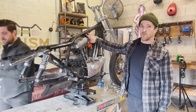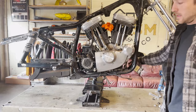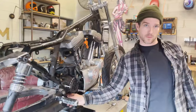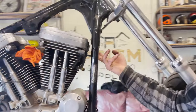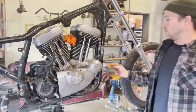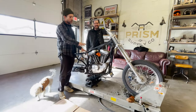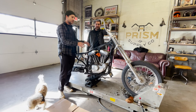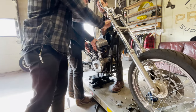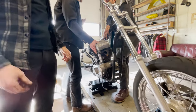There's a top motor mount — ready to remove that. There's a motor mount on the front right side, also on the opposite side on the left side, and then there are four bolts that hold the back of the transmission and transmission mounting points — right here and at the top in front of the exhaust. So this bracket goes to here. Five different mounting points. Once you remove all the engine mounts, it looks like the engine wants to go out that way, but it actually only comes out this way. You want to get the top out first, and then from there you can lift up on it and pull the whole engine out. Once you figure it out, it's pretty straightforward and easy.